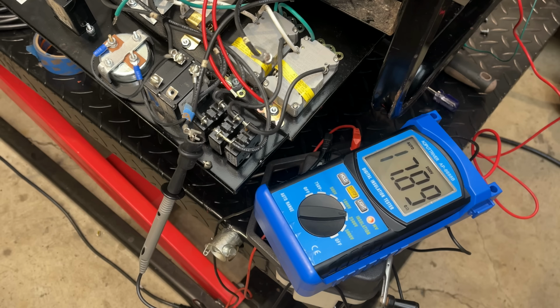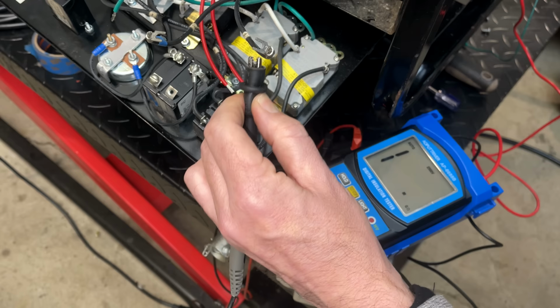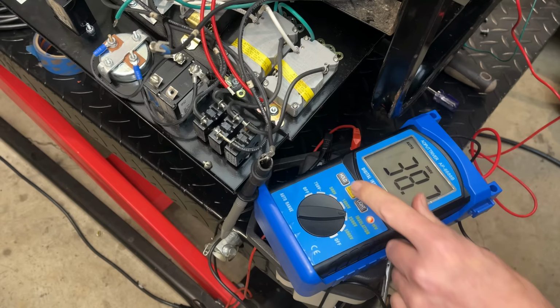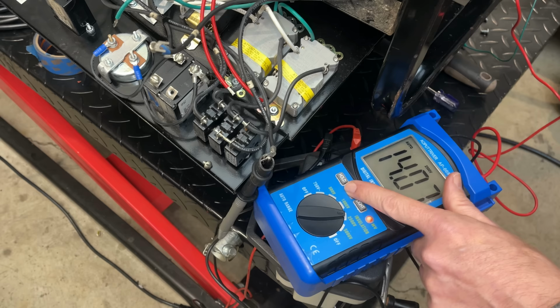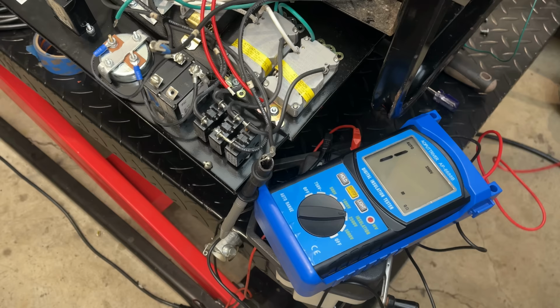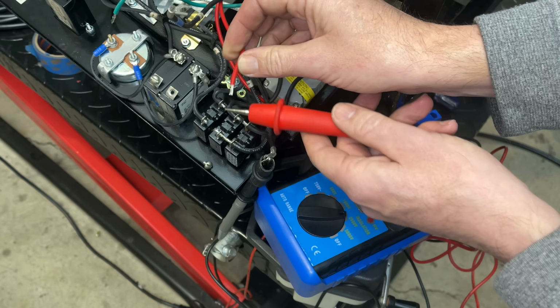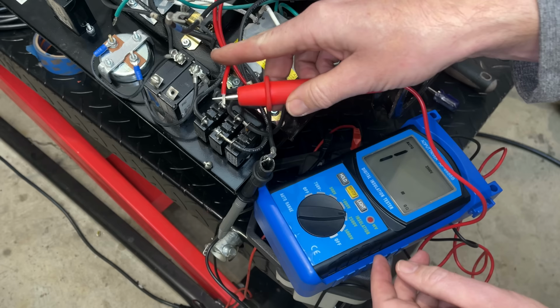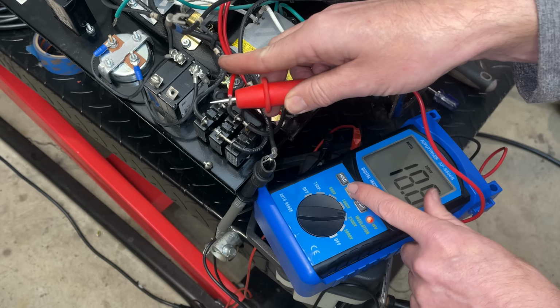We're at around 4 gigaohms, no issues there. Check the other leg. And we're at about 10 gigaohm and climbing. So no faults to ground from anything. So let's check from this leg to the excitation winding. And this is where it gets a little sketchy because there's no clip here. So we'll try not to touch this at 2,500 volts. And we're at 18 gigaohm, no issues there.